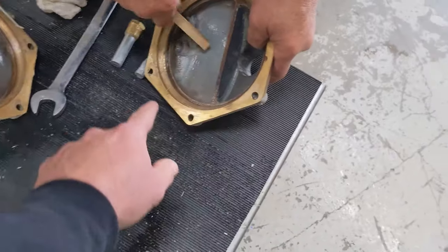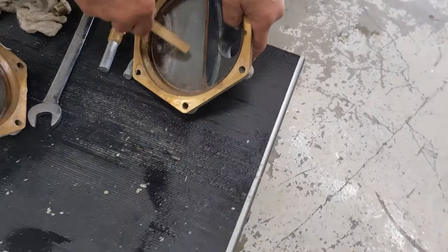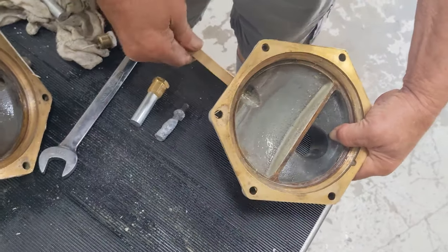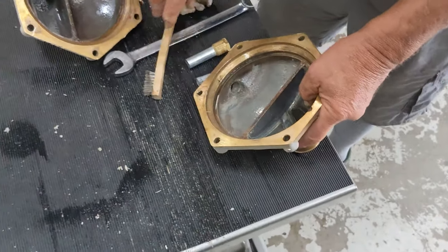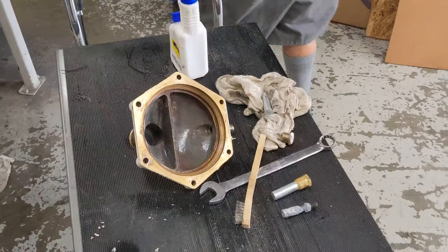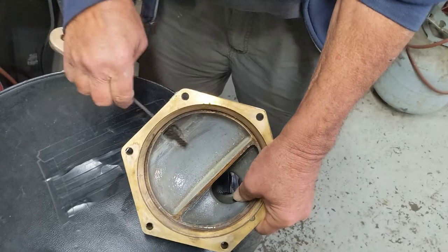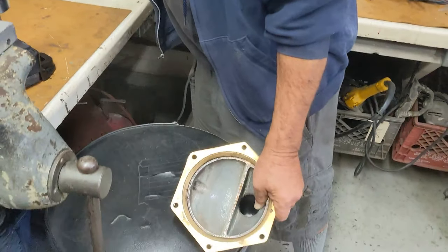So we chase the zinc threads with a half-inch pipe tap. You can also jam in one of these little toothbrush-sized wire brushes. The worn-out one almost works better. Or the ones on the plastic handles, they're smaller. These guys, yeah, those work good too. Get a big one for half-inch pipe, it'll fill the whole thing.